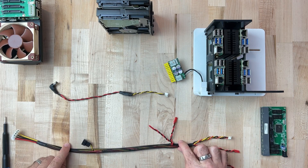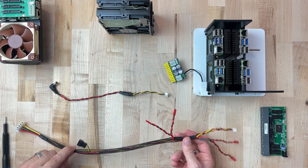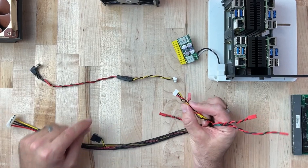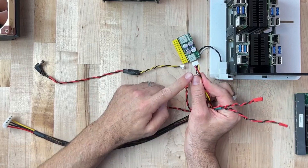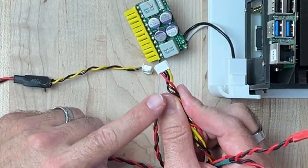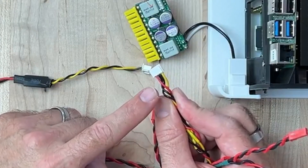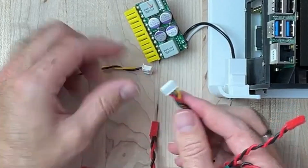Let's start with the main wiring harness. This is actually being fed from this end here — this goes to our Pico PSU, and this has your standard 5 volt, ground, ground, and 12 volt. Standard wiring: red is 5 volt, black of course is ground, and yellow is 12 volt. So we need that voltage range.